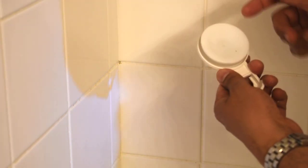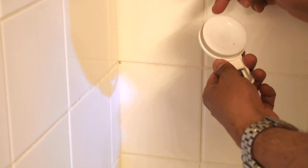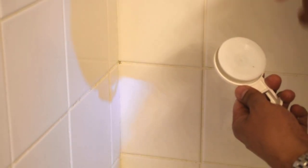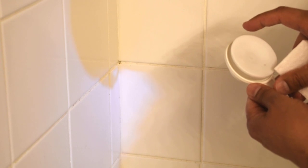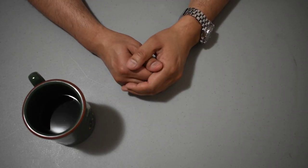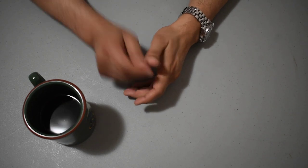To reapply, watch my other video, but the area you contaminated with baby powder needs to be cleaned off with isopropyl alcohol and a rag — let it dry so it doesn't swell the silicone. Once it's evaporated, clean the tiles where the suction cups will be adhering, place them on, push them in and they'll stick just as well. Please leave a like if this technique helps you. Thanks for watching, see you next time.